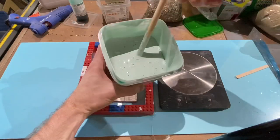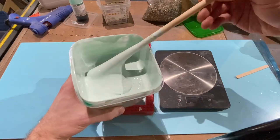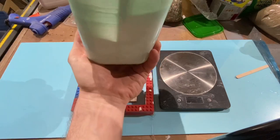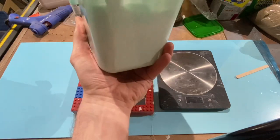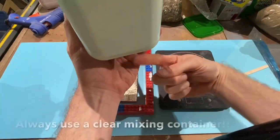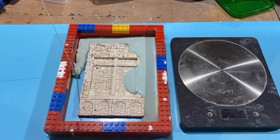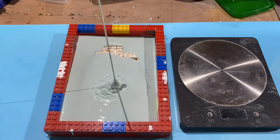So I've mixed up my silicone here. I've made sure to mix it until it's a really consistent colour, including scraping across the sides like this to make sure you get all of the white unmixed silicone off the sides and mix it in with the green, doing it nice and slowly. I've been doing this for about five minutes to make sure I get a consistent colour and introduce as few bubbles as possible. I've checked underneath to make sure there's no white bits. My casting consultant Ian has informed me this is good enough, so I'm going to pour it now and put it on a time lapse. Following the steps I poured it from very high up - at least three feet over the surface - once the stream started, to make sure it's as thin as possible and get all of those bubbles out of the mix.